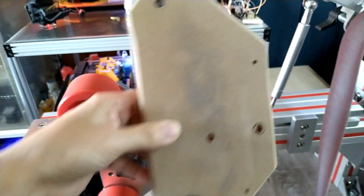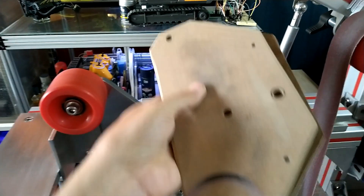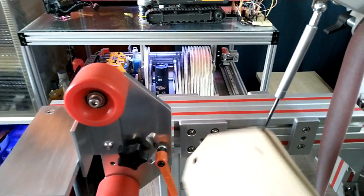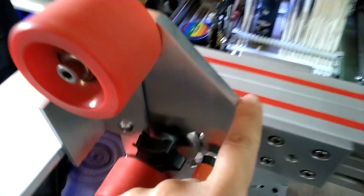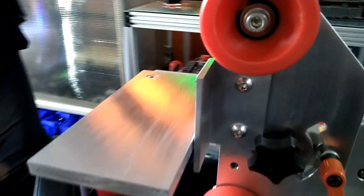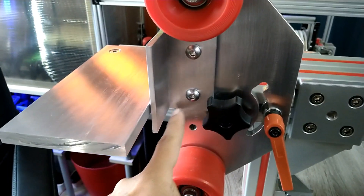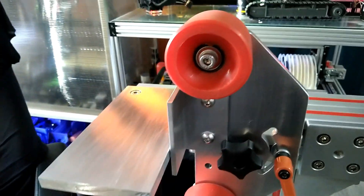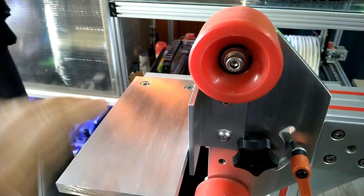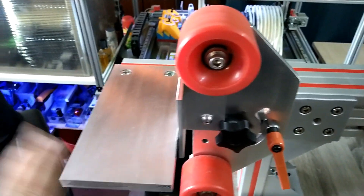I made this plate — I still don't remember what you call it — out of MDF, two pieces because they're thinner. You can see it did rub a little at the beginning, so I had to put another washer in there. That way I could take it out and do the edges and small radiuses. I had to drill three holes: in the upright position I use the top two holes, tilted back 45 degrees I use the other hole and still have a platen.